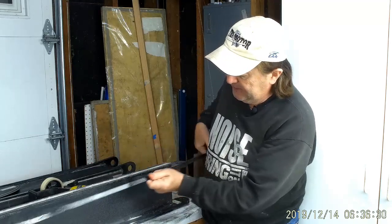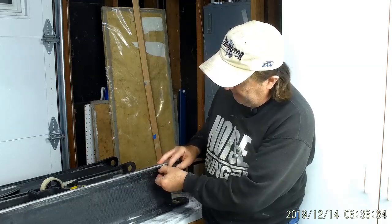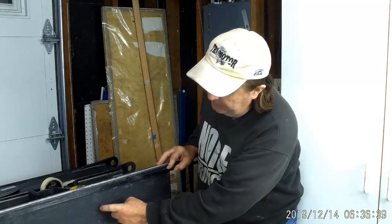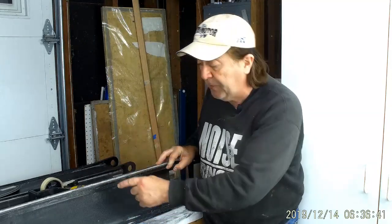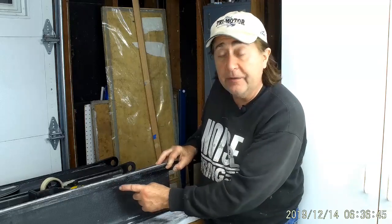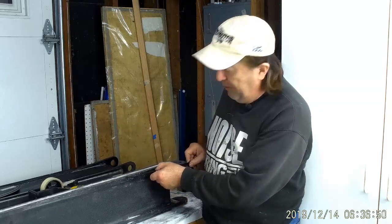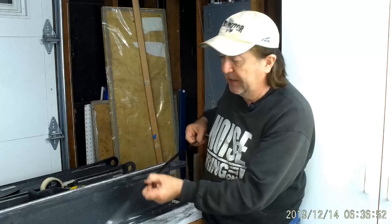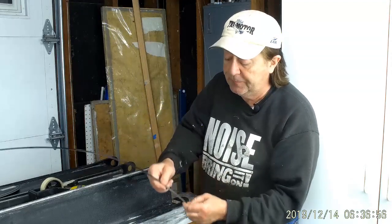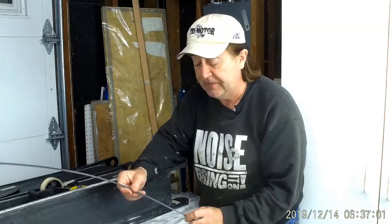So that this load strap, as I like to call it, is the same size as the height of the fitting, and it gets bonded to the shear web here, to the carbon fiber that's on the shear web, which is bonded to the spar caps underneath. So this load strap is transferring loads into and out of the spar caps that are embedded in the wing. Now, by stretching this bond length, this is very lightweight. There's not much weight in this. Each one of these strips, each one of these individual strips can take 1,200 pounds of tensile load.